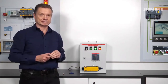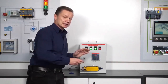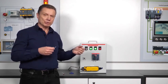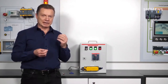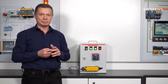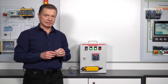Once I have completed my work on this panel, I close the door and it is automatically locked again. Now all doors are closed again. This time of 10 seconds is, of course, a time that I have programmed in the Logo — the time is freely selectable. A time must be chosen during which it is reasonably possible to get to the last control cabinet door in the panel; that is, at a distance of 15 meters and within sight, according to the standard. In this case, 10 seconds are sufficient, but this can be changed at any time.